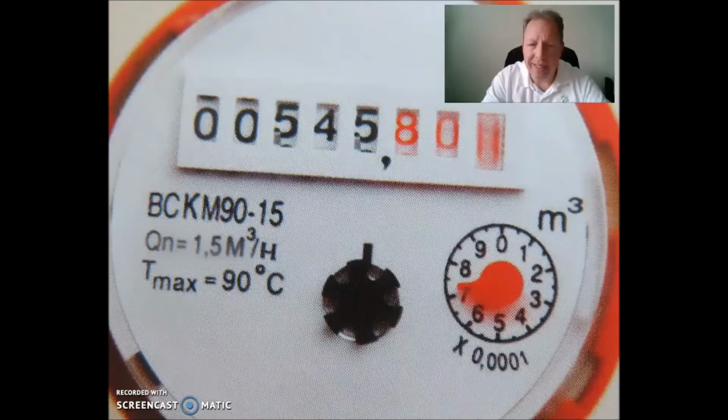Toilets, well, one, you can listen if it's a more severe leak. Sometimes you can hear it running, but oftentimes it's a slower leak. So you could take a little bit of food coloring and put it in the tank and come back an hour later. Obviously, if the water in the bowl has now changed colors, that toilet flapper needs to be replaced. Same thing, you can go through and check your sinks for drips or leaks underneath the sink, shower heads. Do due diligence and do a little bit of checking, investigating on your own before you get the plumber in.